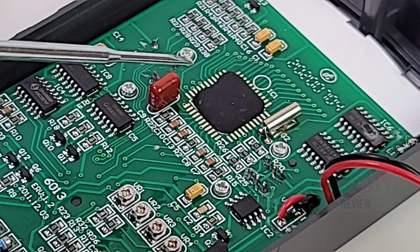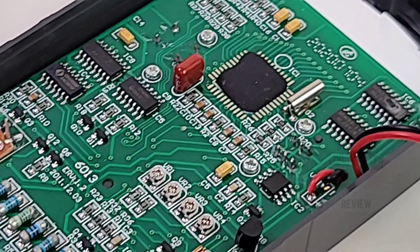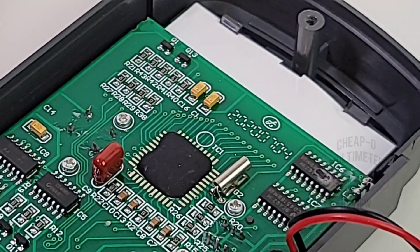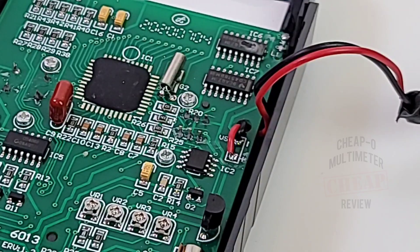The main IC is cobbed, but there are a couple of op-amps — the TL062P — and some hex inverters, the CD4069s. Your usual assortment of components. Overall the board is clean with no flux residue and good attention to detail. The only thing I'm not super happy about is the 9V battery connector, but it is what it is.